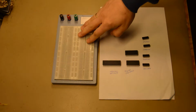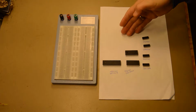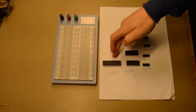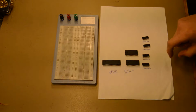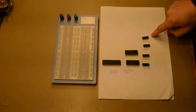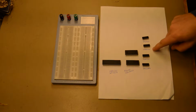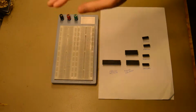This is the breadboard on which I will build the core system, and here are the key components. The 6502 from Western Design Center, and then we have two 32K SRAMs and some logic. I seem to have managed to pick 4 different logic families for the 4 different chips. Well, that is what I had in my box right now. So this is going onto this board.